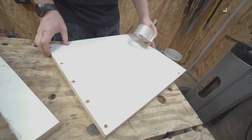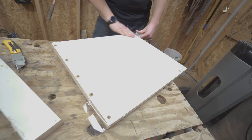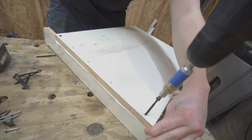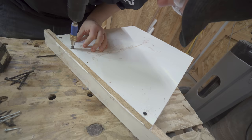With the pieces all prepped, it was time to get the mold ready. I was using melamine and I always cover all of the surfaces on the inside of the mold with packing tape — this helps the epoxy release better from any surface it's touching. After the mold was taped up, I screwed on the first wall and added a bead of caulking on the inside, just to keep the epoxy from leaking out, putting it inside the seam and on the corner of the inside of the mold.